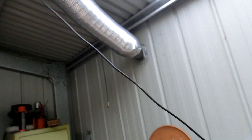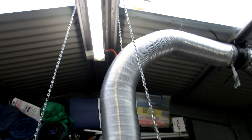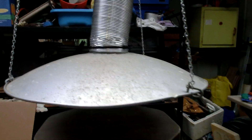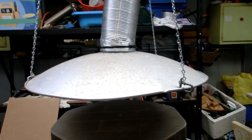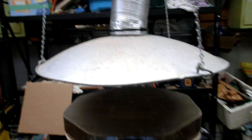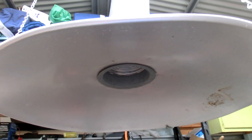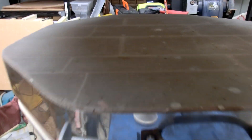I've put a little cap with a grill on it on the outside there, so it just takes all the toxic fumes and things out of my work area. The fumes from the kiln can be quite corrosive — they start to make all my tools rust — and it's not a good idea to breathe them in anyway.